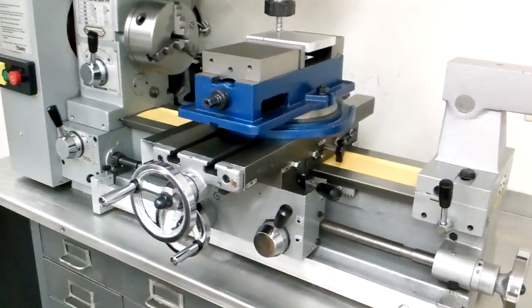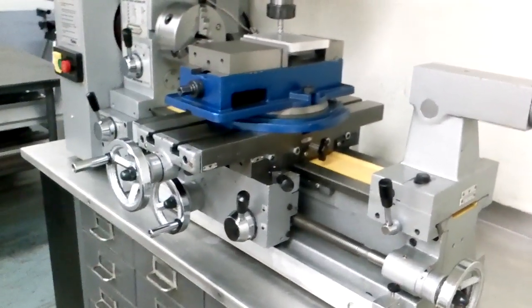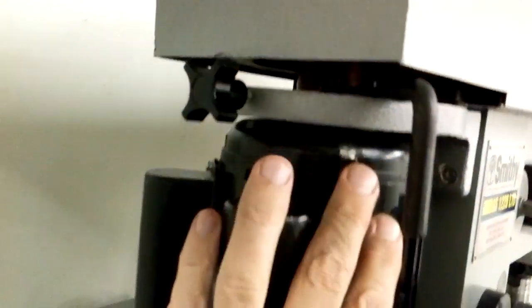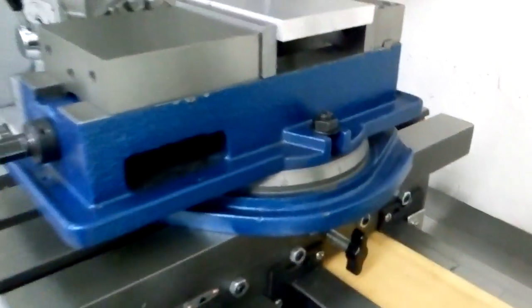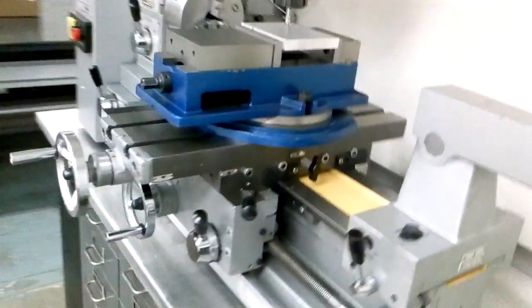You really have to constantly check that as you use the machine if you want to maintain that kind of accuracy. A couple of simple things I did: I replaced all the thumb bolts — all the screws that required Allen keys — with thumb bolts. This one's for the mill motor so I can change speeds real quick. For the Y lockout, I put one in here — that's unlocked, that's locked. And I got one for X here; it was in a real uncomfortable position so I put a bigger one in that I can grab easy. That's locked, that's unlocked. During operation you can lock out that one axis real quick.